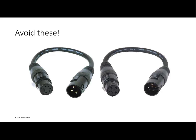by the same token. Some will make the argument that you don't necessarily need all 5 pins. So what? Your DB9 connectors with your RS-232 interfaces, your VGA connectors, don't necessarily use all pins. Exactly. So, I say, these adapters are just sort of a travesty to me. I put a lot of this back on the user, I'm afraid. Why are there 3-pin connectors being used in the field for DMX? Because the consumer allowed it. It should be 5-pin XLR. I have a religious fervor about this, so I'll let others speak to it if they wish.